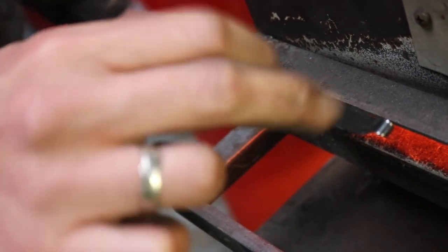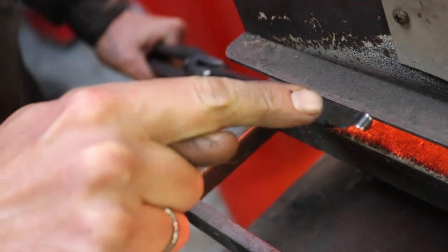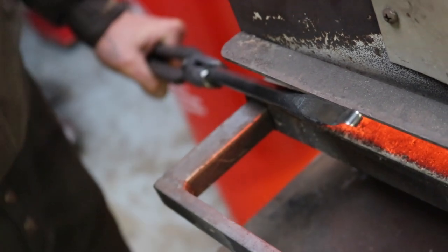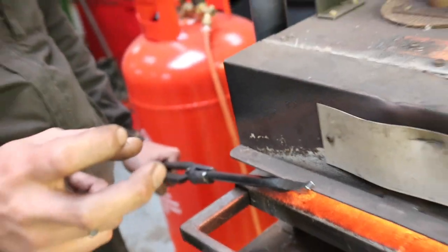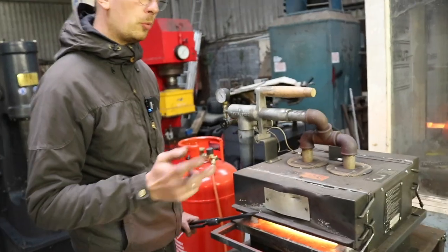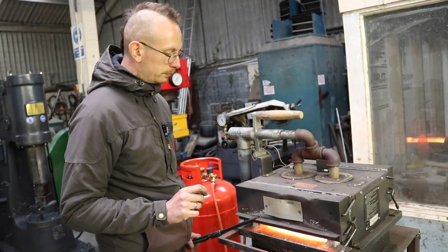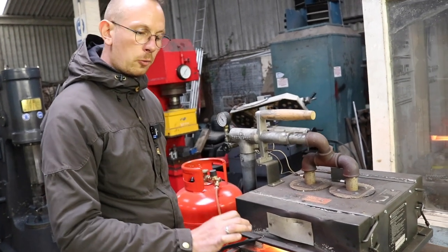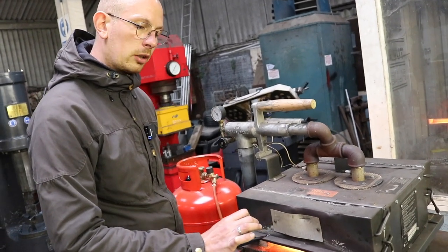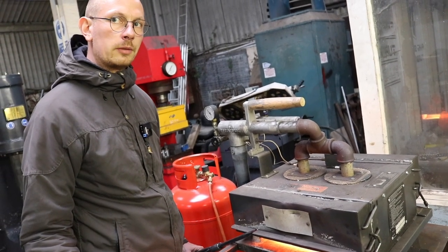But not the purple at all. Not in the main cutting edge. The purple can be in the neck of the tool. Purple means it is a little bit softer, so it will hold the edge, but you will have to sharpen it more. So golden is ideal. And what we do, we wait until we see the colors rising, and once the golden color hits the tip of the tool, we cool it down in water.